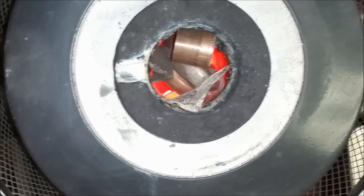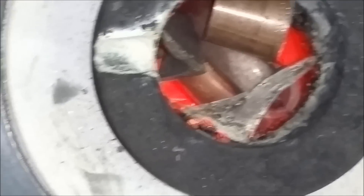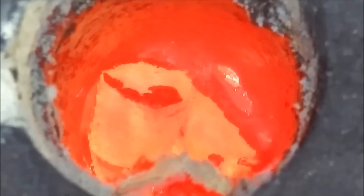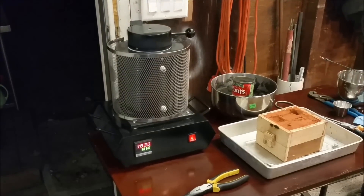We can see a glowing orange down in the bottom and the top is still relatively cold. I'll shut this up, check it in about 10 minutes, and give you another update. The time is 7:03 now. All the metal has dropped down — you can still see some hard pieces in there, but it's mostly melted. We're going to let this sit for probably another four or five minutes and then add some more brass.